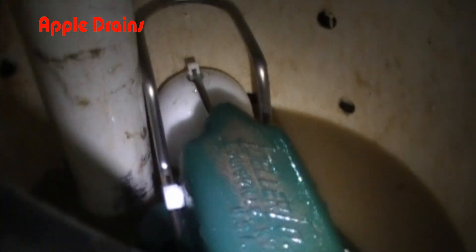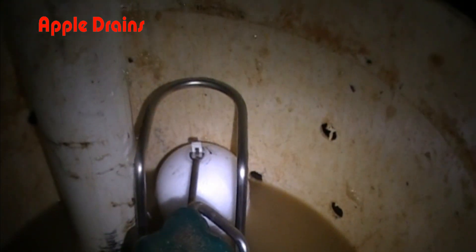Let's look at the main reason why a sump pump should never be installed in a five-gallon bucket. The main reason is because the float tends to get stuck on the wall — the pump's just too big for that bucket. It works temporarily, but when that float gets stuck against the wall, it's either going to be in the on position or the off position. Either way, it's going to be a problem for your sump.